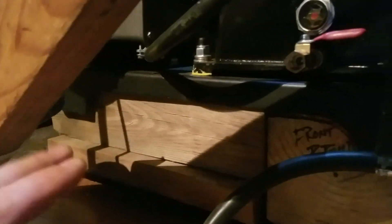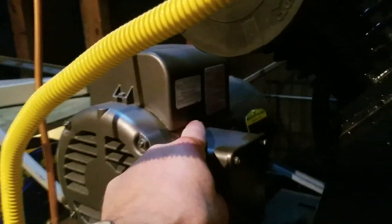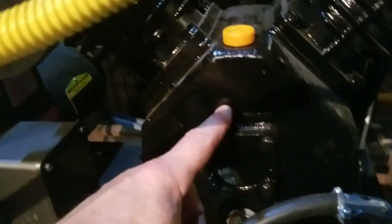I grabbed a little 120-volt box leg off of that wiring — this is all old school. I've got a 125-amp sub-panel box at my front door right now, UPS just delivered. I don't want to change out all my electric in here. For all intents and purposes, this box is not grounded, so I've got to get all that straightened out and get in code. But for now, I've got this 5-horsepower motor servicing a 5-horsepower Harbor Freight pump, single-stage two-cylinder.